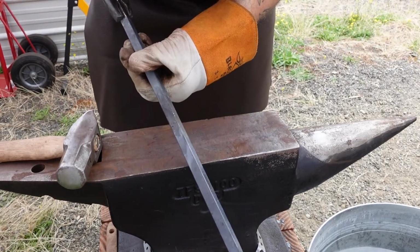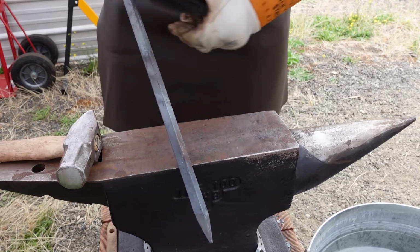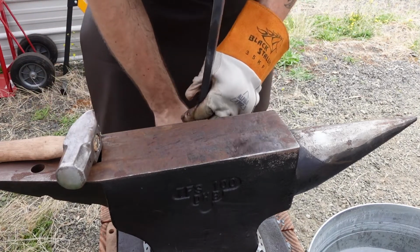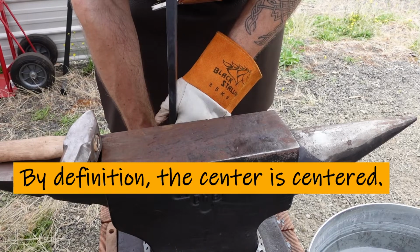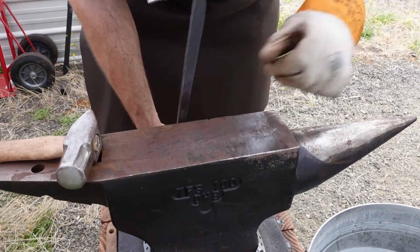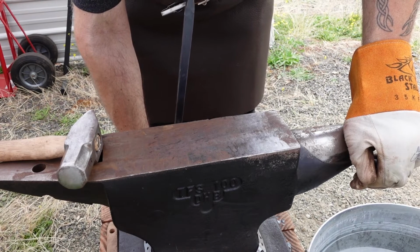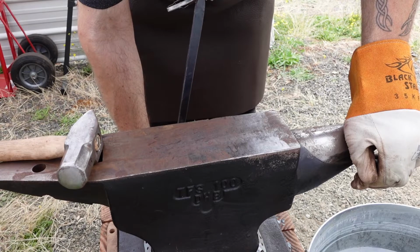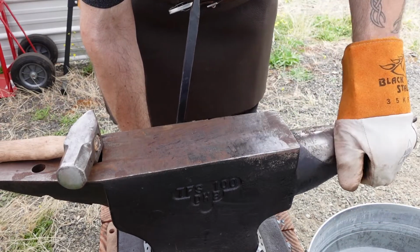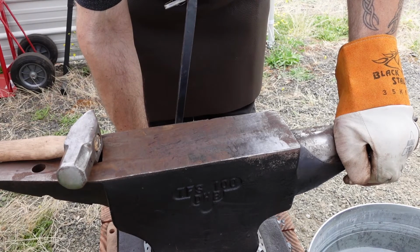That diagonal is wobbly, that one just kind of curves slightly, that one's fairly straight, no, it's kind of canted at an angle too. The center is pretty well centered, though. The edges kind of spiral towards it slightly. What does that tell me? That should tell me something. That face for sure had the hammer at the wrong side, at the wrong angle, because the opposite side is flat where it was pressed up against the anvil. But then this side is canted at an angle, like I had the bottom of the hammer too far down. That's kind of what it looks like on that side too.